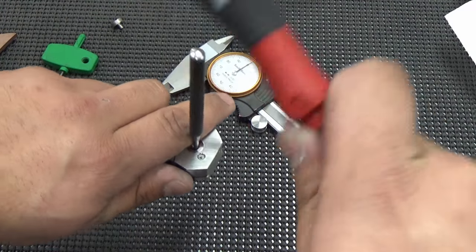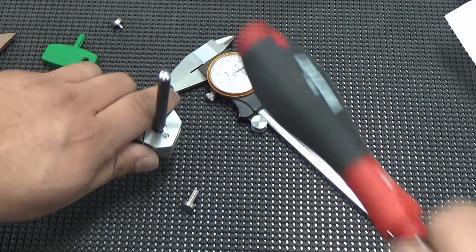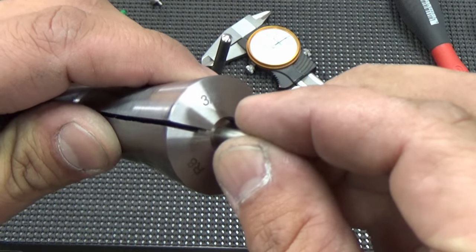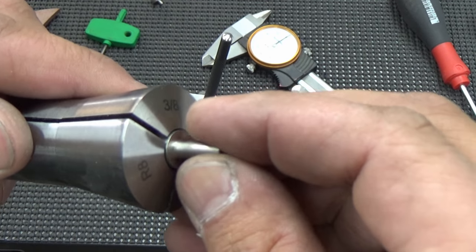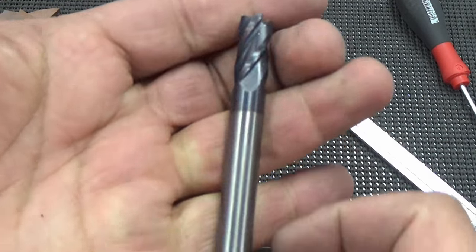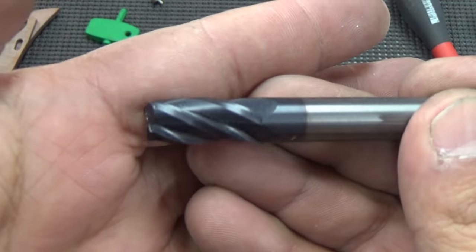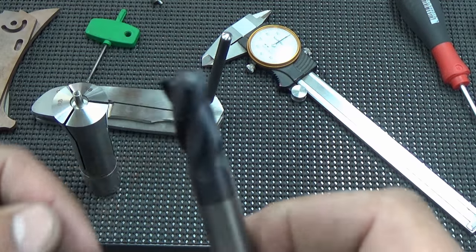You don't have to take the whole thing apart — just get your hammer and knock your pivot out. So we've got our 3/8 collet, 3/8 flat head pivot, with just enough material there to hold on to. Once we tighten that down it's not going to go anywhere. This is just a 4-flute carbide end mill of any kind — it has to be carbide because these are hardened steel. Don't try to use high speed steel; you're just going to have it doing a burnout on top of the cutter and it'll make a mess. Carbide is the way to go.